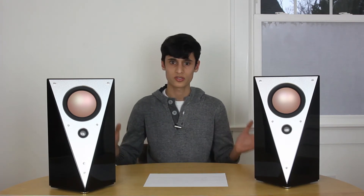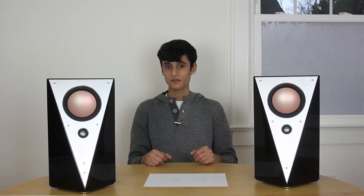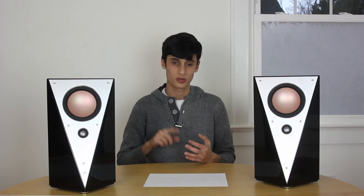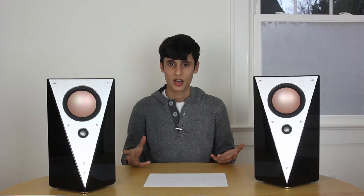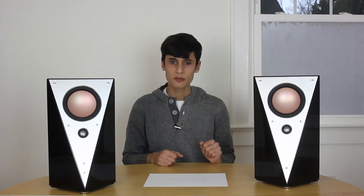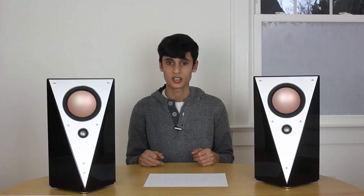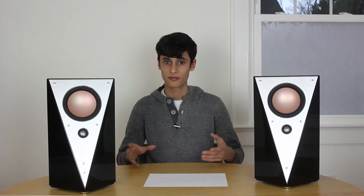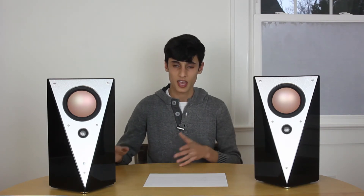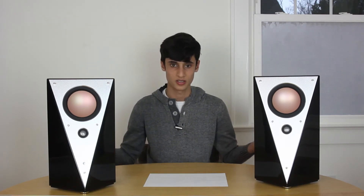This is a really cool feature that almost no active speakers have, unless you're looking at something like Genelec or a really high-end brand. The speakers also have a volume control and a balance control, both adjustable on their remote. One caveat: the balance is not adjustable on the speakers themselves, so if you lose your remote you're kind of stuck. For inputs, you have two XLR left and right inputs and a Bluetooth 4.0 input. The XLR inputs can connect to a full-balanced XLR or two RCA inputs via included XLR-to-RCA cables, and they also include an RCA to 3.5mm jack.